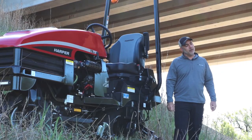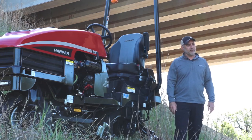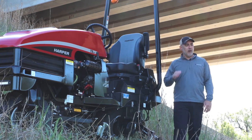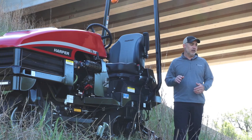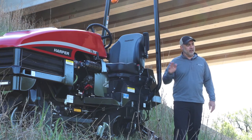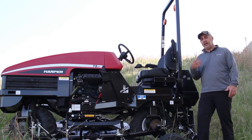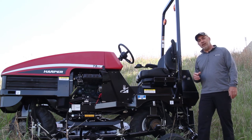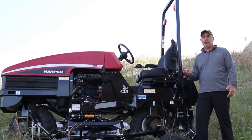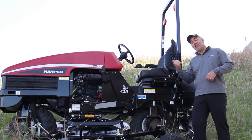The second most common question is where does this unit get used? Today we're actually on an overpass — a perfect example of an area where our distance horizontally is longer than what we will mow vertically, so to be efficient we mow horizontally across the slope. Some other common places similar to this are levees, water retention ponds, and even wastewater treatment plants. In our next video we're going to show you how to get some work done and mow this slope safely.